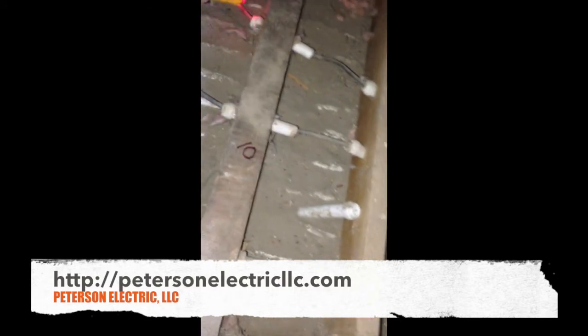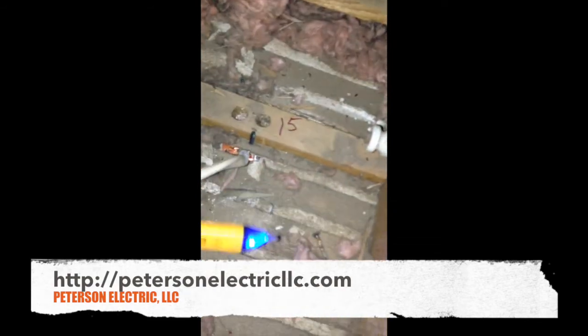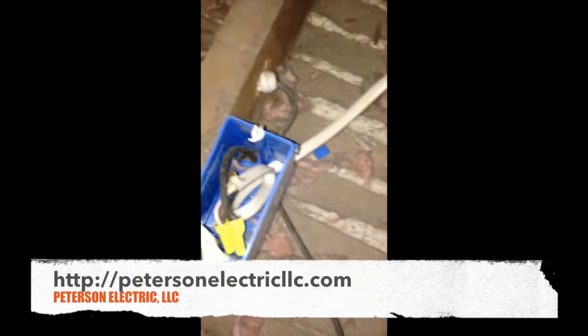Here's some more knob and tube — and then it ends. Neutral goes this way to a light fixture. Here's your neutral going down, but you don't need a neutral in a light switch box — but they do. Here's your hots, and then we have two switch legs — hot, neutral, switch leg. This switch leg comes over to the living room. He put a deck screw that almost nicked your wire. Coming over to this splice, this is your switch leg in, which they brought into this box. Then they took the neutral this way and decided to travel it to there. So if you're an electron coming back, running a 1500 watt space heater as a tenant who doesn't know the difference, all that current is running all the way back through all these bad splices.